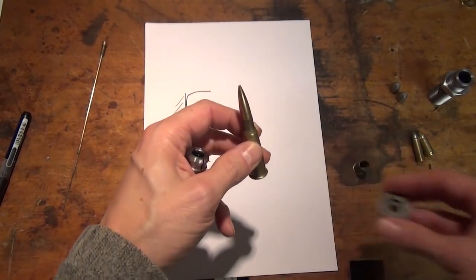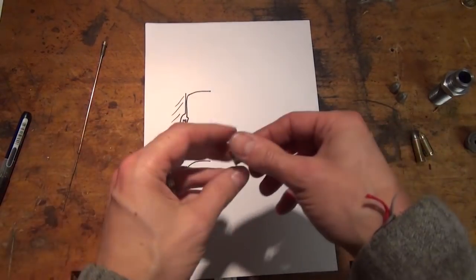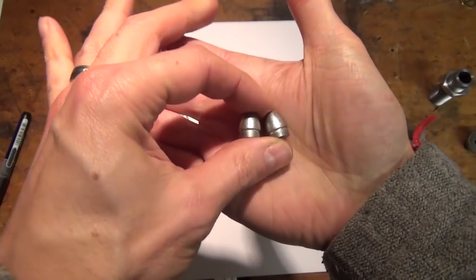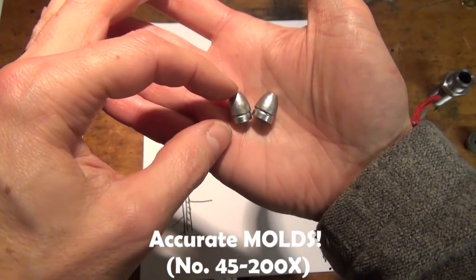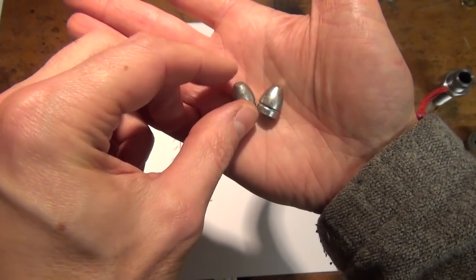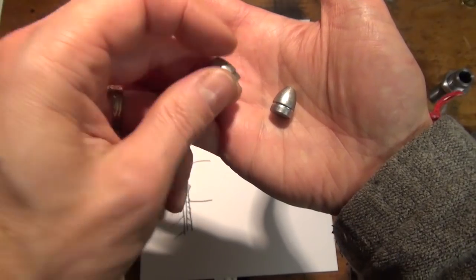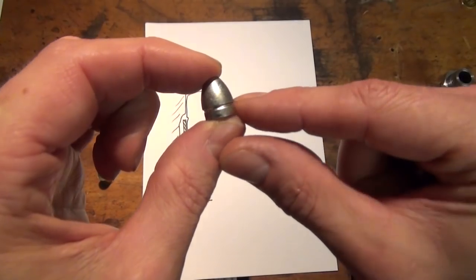So this is what's available to work with, and what with the situation we have for the 11mm cartridge. These are the bullets. They come from a modified Accurate Arms mold, very, very close to the original projectile, which have a sort of rounded pointy end, but of course these are nose pouring. We can't have that, and the originals had a slight cavity, but they are heeled, and you can see there's a crimp groove here just under the maximum diameter.